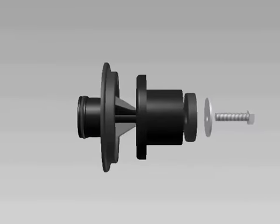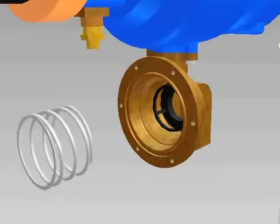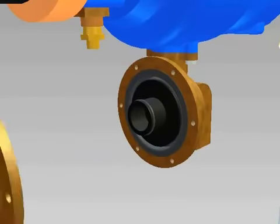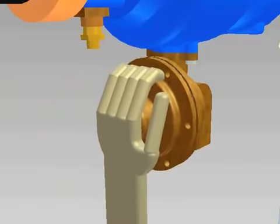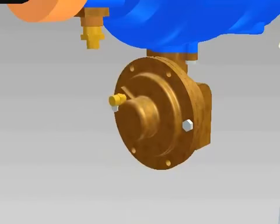Clean the components and replace any damaged parts. Carefully reassemble the cartridge and tighten the seal ring retainer screw. Lubricate the o-ring on the upper plunger. Place the spring around the seat and the body, then insert the cartridge assembly into the spring. Place the cover onto the cartridge assembly and push the cover towards the body, making sure the cartridge centers into the seat guide ring and the bead of the diaphragm fits into the groove in the relief valve body. Align the hose fitting on the cover to the left of top center. Thread two screws into opposite holes by hand while holding the cover in place, then thread the remaining cover screws into place and tighten all screws evenly. Thread the hose onto the fitting on the relief valve cover and tighten with a wrench.